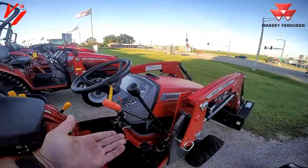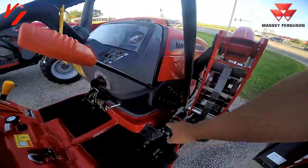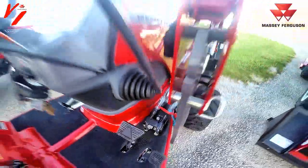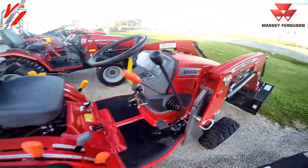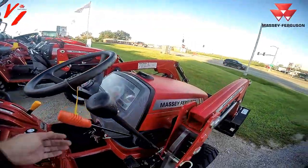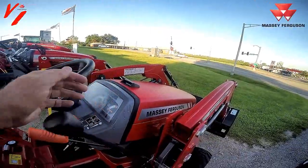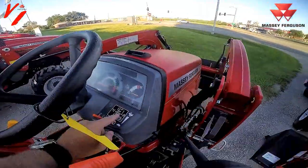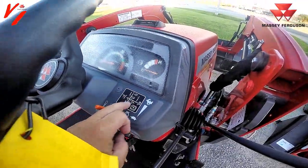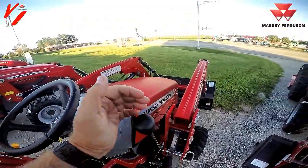Next is a tractor mounted joystick. As you'll see here, the joystick is actually an integral part of the tractor. The couplers are connected by a remote coupler install. This is actually a GC series compact from Massey Ferguson, which offers an integrated joystick. We'll just start it up. It's got the up, down is this way, left and right are your features. And you can see by the dash decal, you have your up, down, and you have left and right. And it does have float position.